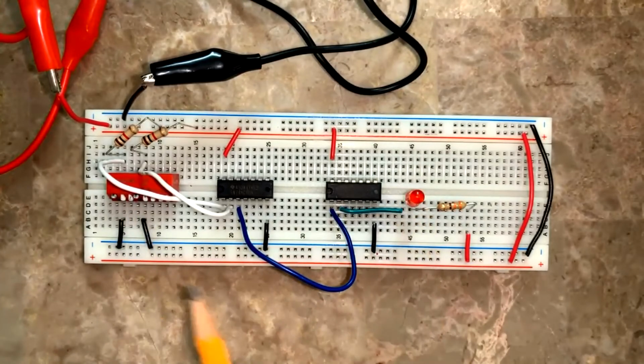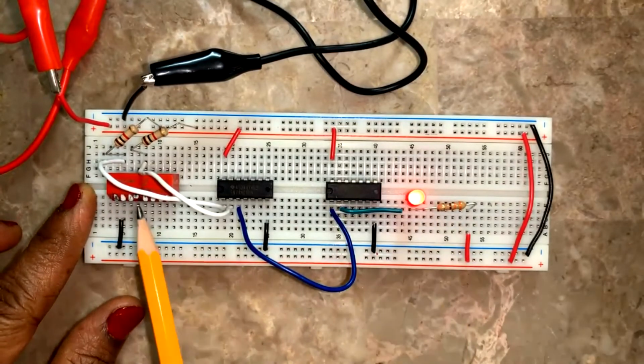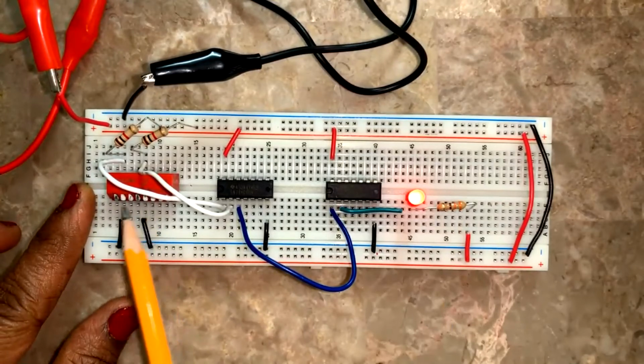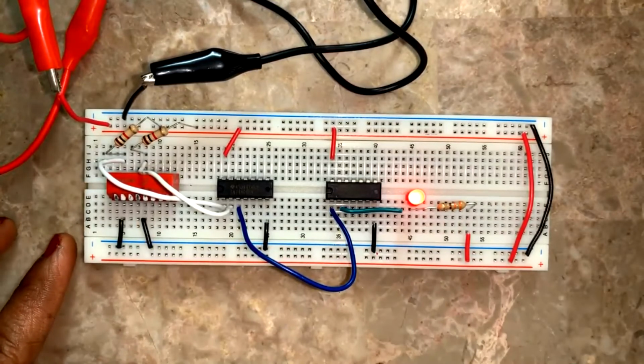Only then. All other times when there is a 0 in any of the inputs of the NAND gate, the output is a high. Both low is okay, good. Both are low and it's a high. NAND gate is finished.